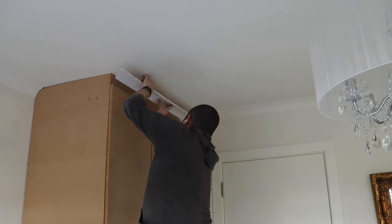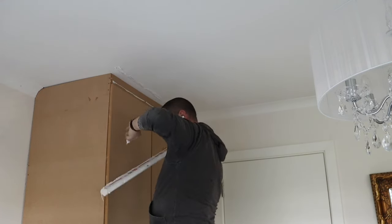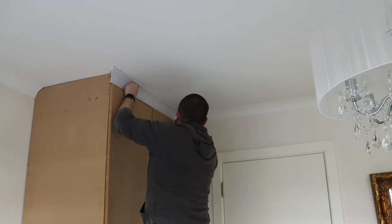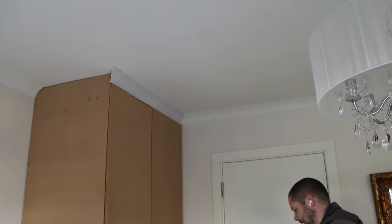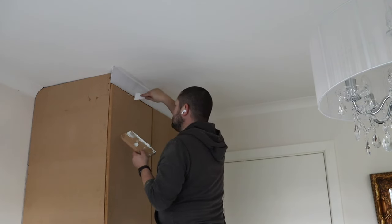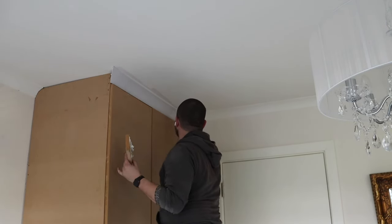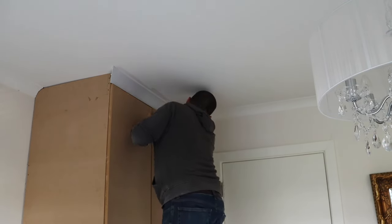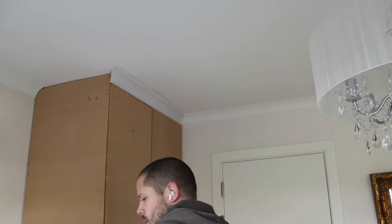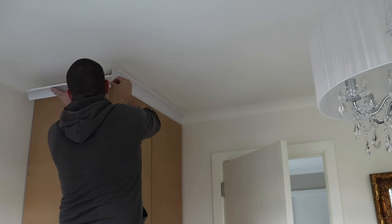We're on with the coving now. I spot the mistake here — that's the point of realisation — I got myself in a mess and put it on the wrong way around. Coving can be right finicky. Just using the nail gun, I find this gives it a really nice temporary hold, just enough to hold it in place while the glue goes off. It's not like putting a screw in it — it doesn't need loads of fixings, and I didn't want to screw into the carcasses as that just creates more filling. And there we go, final piece going in place.